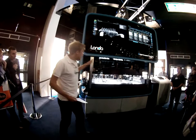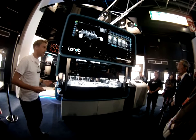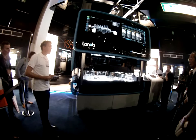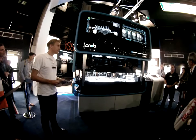The imaging system enables the ejection of nano ink from the print bars, one color from each single bar. The ink is ejected onto the blanket as in offset presses. And when the ink is dry, it is transferred to the substrate. And because the ink is already dry, it isn't absorbed into the substrate. The Landa Nano Ink chemistry and process, which are used in all of our presses, provide high abrasion resistance, excellent conformity of gloss to paper, and high color density, even though a very, very thin layer of ink is applied to the paper.